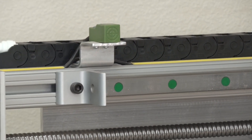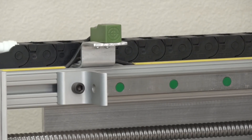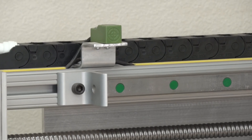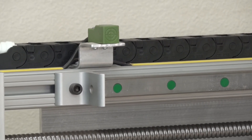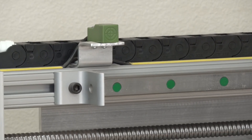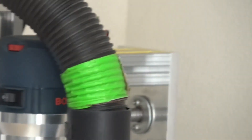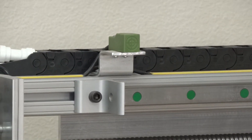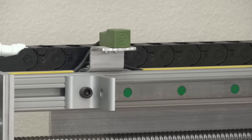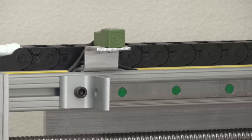Some of the other things you want to make sure your CNC machine has are limit switches. These switches protect your machine. I would highly recommend limit switches on both ends of your X and both ends of your Y. When you're learning how to use this machine, if you don't have these safety switches in place, you can crash your machine and do a lot of damage. Standard, they come with two — I would highly recommend you upgrade and put in two more. That way you really have no chance of crashing your machine.